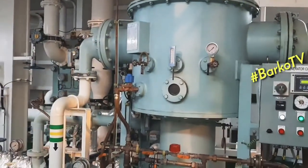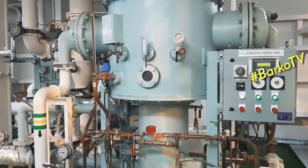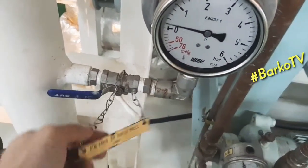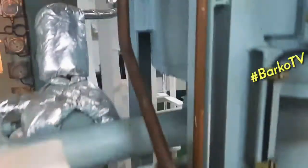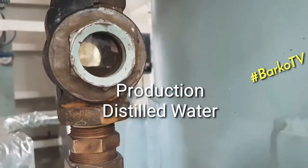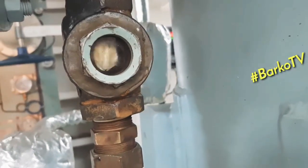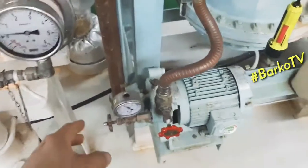Right now: at the top is the condenser, below is the evaporator or the heat exchanger. This is the outlet pressure for our seawater — as you can see the valve is open, going to overboard. This is the sight glass for the fresh water or distilled water being produced, going to the distillate pump and then discharging to the tank.